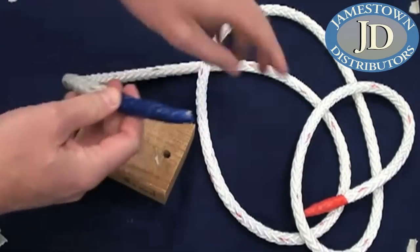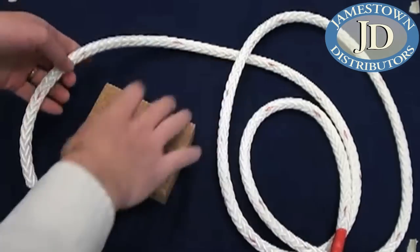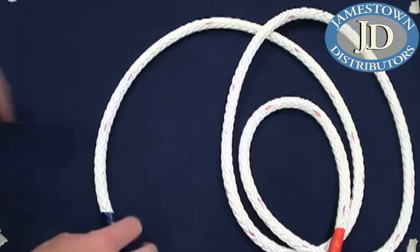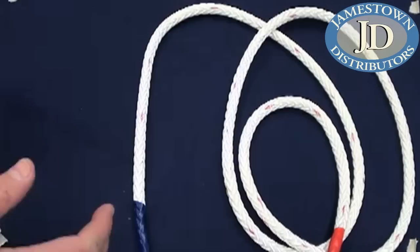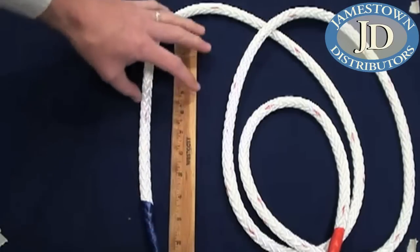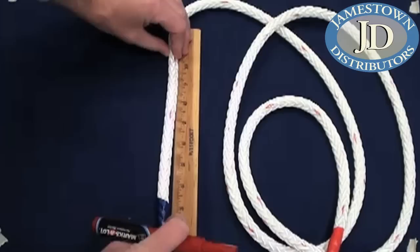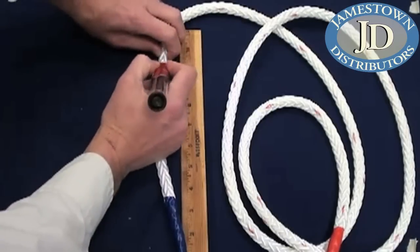I've already done the same on the other side in red, so you have a visual idea of the two ends of the rope. The first step is determining how long of a tail we want. Your tail has to be at least 20 diameters - this is half-inch rope, so 20 diameters is 10 inches. You could always make it longer. If you didn't have a ruler handy you could use a piece of paper or some other tool - longer is good, shorter is bad.